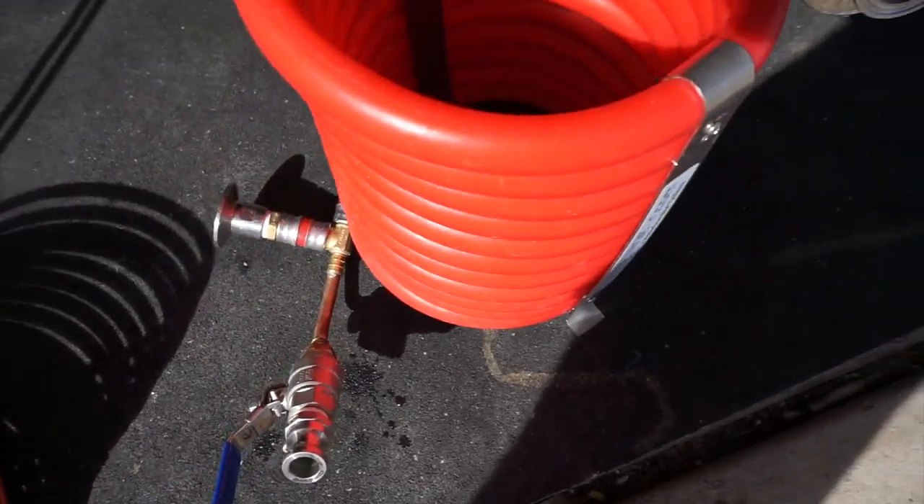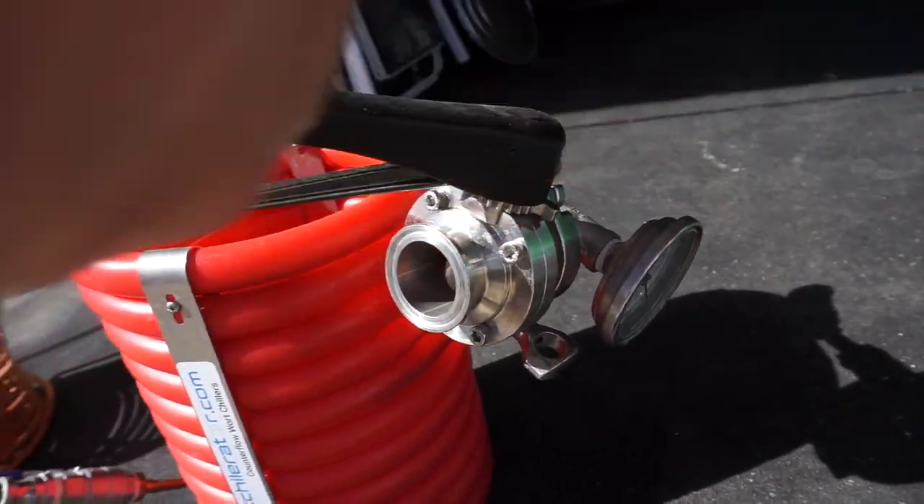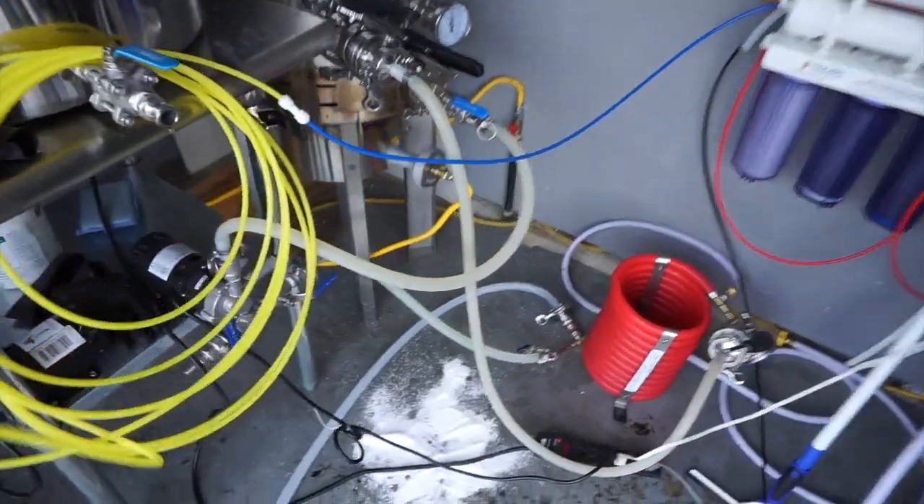Con number three — you physically can't see inside where the wort is running, because it's encapsulated by the outer tube and the inner wort tube is usually about a quarter inch to half inch ID. You just have to really rely on your CIP practice and cleaning regimen. If you like the peace of mind of visually confirming cleanliness, that's a real drawback.